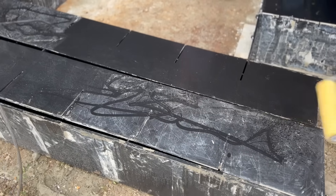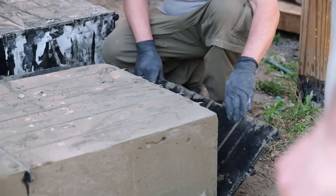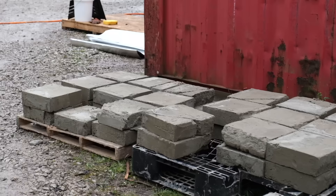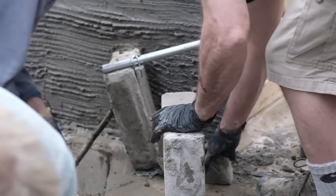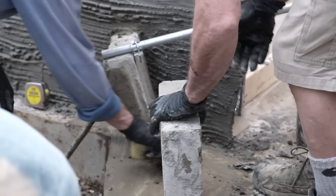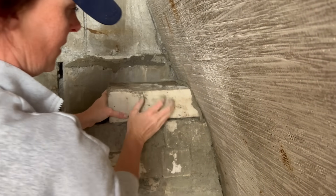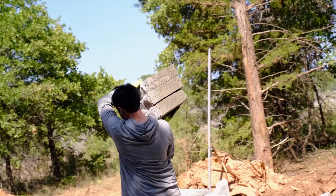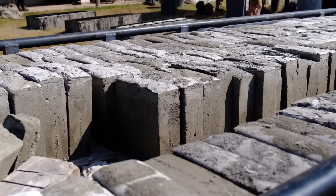We use our own brick molds, typically making bricks anywhere from four inches thick by 12 by 12 all the way up to 12 inches thick. The next day the aircrete hasn't fully set but is usually cured enough to pull out of the molds and handle delicately. In about seven days it's reached around 80 percent of its strength, but you can start building with it right away as long as you're delicate. One of these bricks really just weighs about 10 pounds.